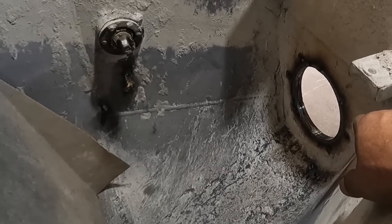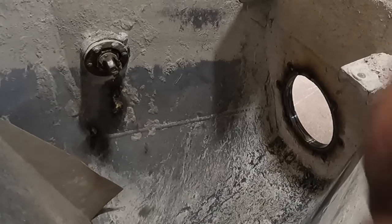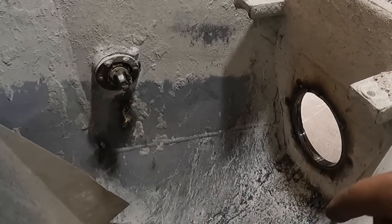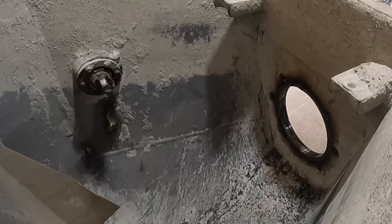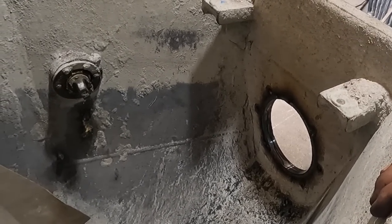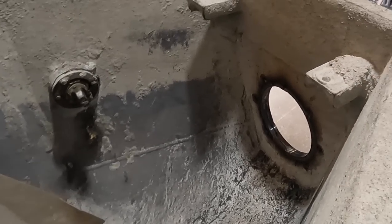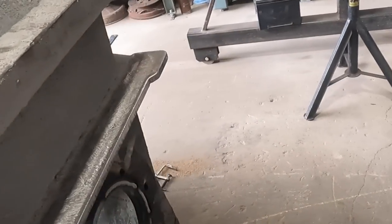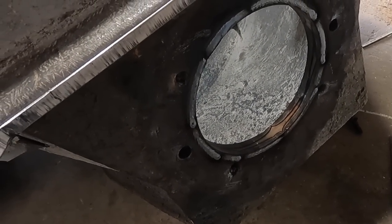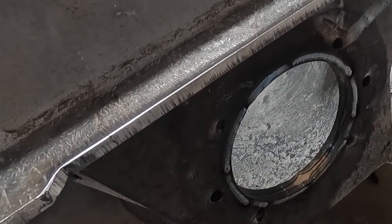Whereas here it was a bit more of a challenge. So on-off pulses, going uphill, make sure you got penetration, because I could see the gap on the way up, but I couldn't see the gap on the way down if I were to weld downhill. Or if I welded uphill, then I'd have these drips hanging out. So to avoid that, just the on-off pulse works fine. So this is done. I'll grind this up here and see how it fits after it cools a little bit, but let me flatten these surfaces.